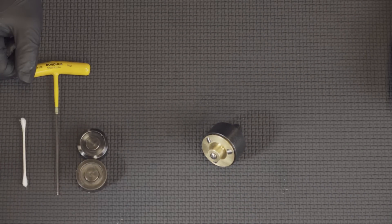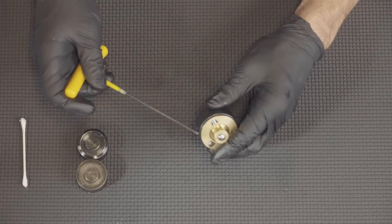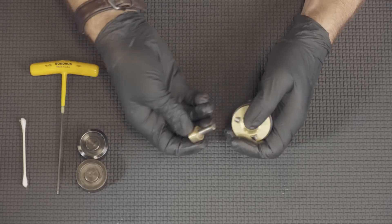Between each lot of parts that are used with the First Side and Second Side Base, the tool should be cleaned of any FOD or debris. Ensure there are no nicks or dings that may cause damage to future parts. The roller swedging tool should be disassembled and cleaned between job lots by removing the set screw, the guide pin, retainer, rollers, and the pilot from the roller swedging body.